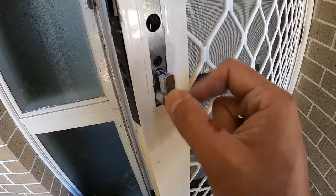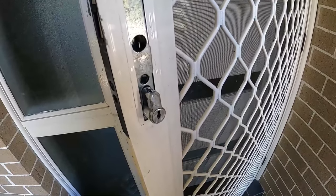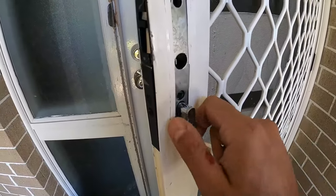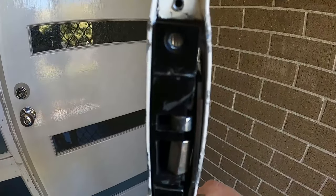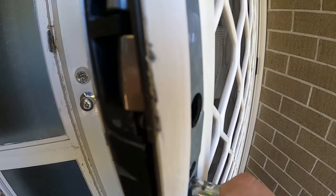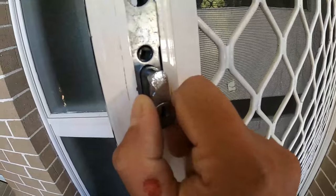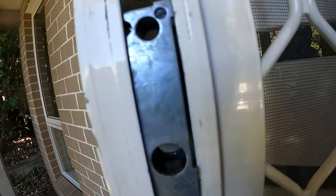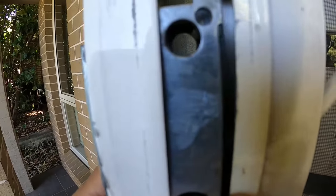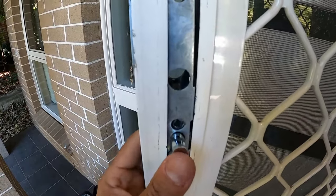So the last option here is to snap the lock. It's actually a pretty easy process — it'll cost you five or ten dollars to replace the cylinder, but this will get you out of trouble. Hopefully you guys will avoid any kind of damage looking like this, because this is absolutely ridiculous. The plate along the side, even where our screws go in, is completely damaged — they pushed through every little gap they could find. This one here is even swollen up on top, you can see it's separated.